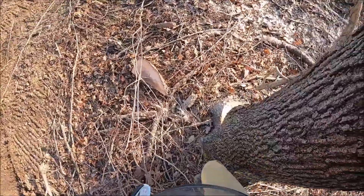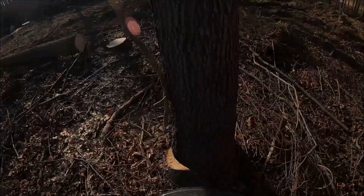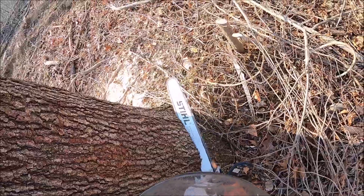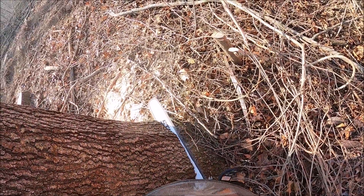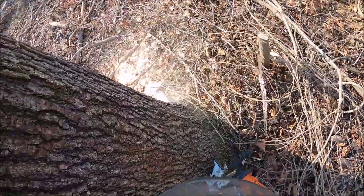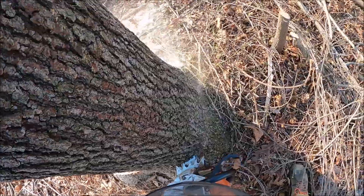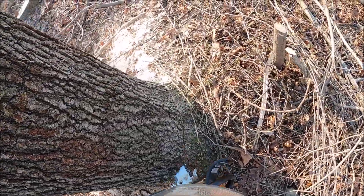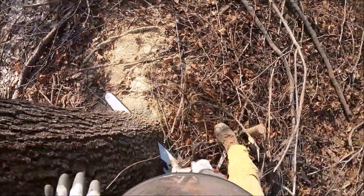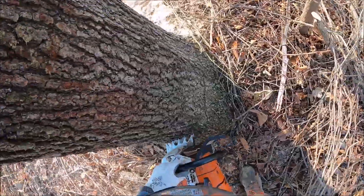So that's what you'll see us doing here — I'll drop six or seven, we'll cut the logs out, and then I'll top them. The excavator will follow up behind me, stack the logs into skids, and stack the tops. Sometimes the tops will get skidded up for chipping material, other times they'll just get piled up and ground. There's been some chipping going on already.